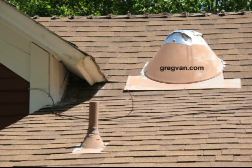They took some sheet metal and bent it over the flue opening. They didn't cut the existing roof flashing and try to pull it over. And again, you could have done something like that in a situation like this, but here's what happens. This area where this house is actually located, it snows here, and they might get about 2 months out of the year where it's snowing. So something like this is going to actually block the snow from coming off of the roof. That's why I would have removed it entirely.